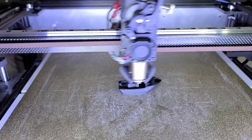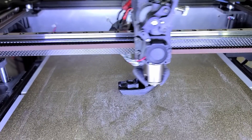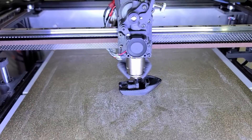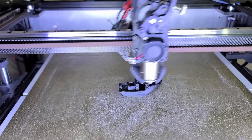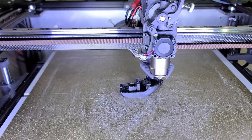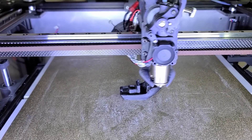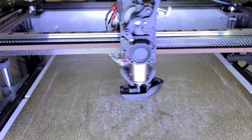Let's see if we can do sub-5 — I'll be happy. It's running 120k acceleration, 90k deceleration, 120 corner speed, and most of the print is done at 350 millimeters per second. I've completely removed retraction as well, so it might have a bit of stringing as you can see.